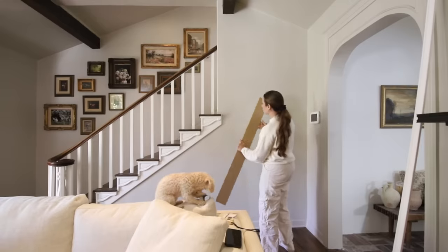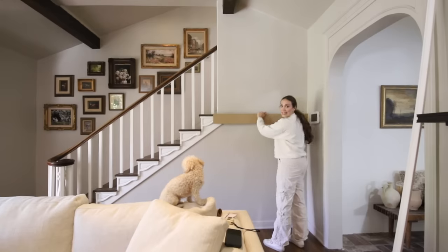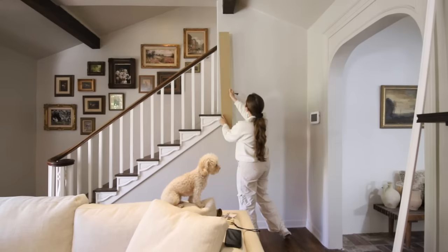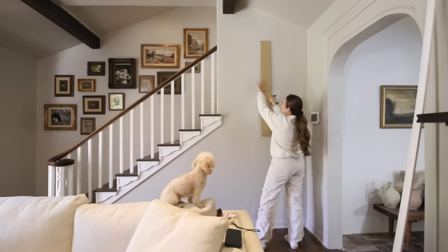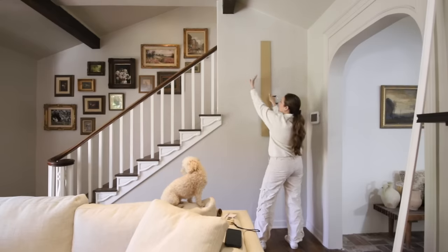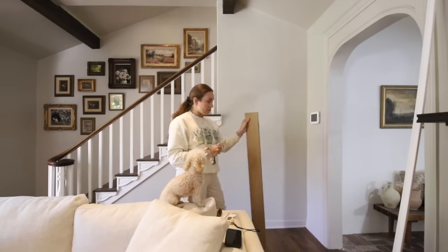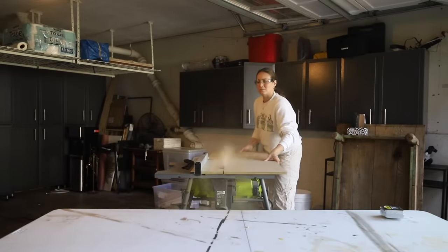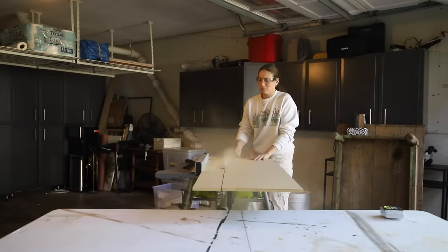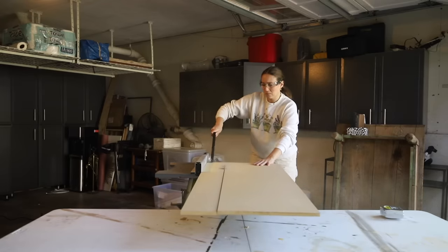We're gonna have a solid piece that kind of comes off of that stairwell straight. And then we're gonna have 5 inches on each side, 5 inches in the middle, and then the design in the center. Cross your fingers that I have enough of this material. So I'm gonna go outside and cut the MDF to 5-inch strips, and then we'll bring them back in and make the angles and start nailing them in place.